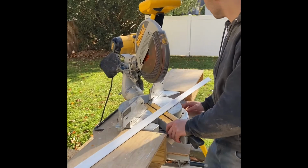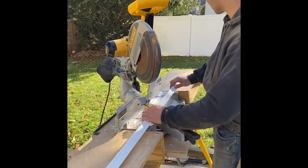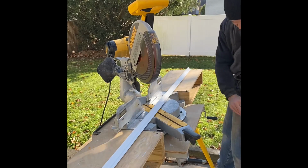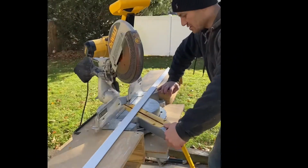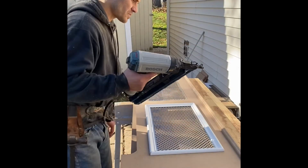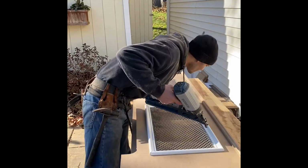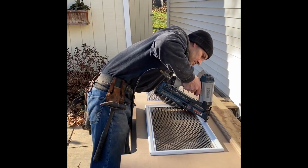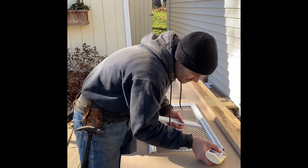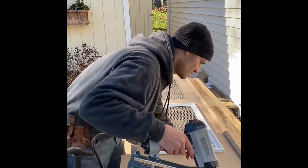First thing I'm going to do is cut a 45 on it. Alright, and I said my number is going to be 23, so I like that. Usually I put the end of my trim right on the end of my table. Works out good. Boom. Then I can kind of hook on the table, you know what I mean? It's all lined up. 45. Alright, and line this cut up. Trim nails in here. Just gonna put 3 nails in it. Again, check my line. The rest of these are going to be in line with that, so I just want to get a little bit of glue in there. Again, I could have glued here, but maybe I will. Why not? So a little bit of glue there, and then I'll just run a little strip. Nice. And then we'll shoot it.